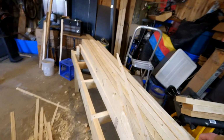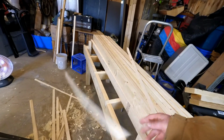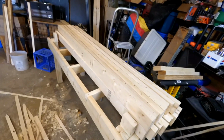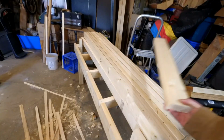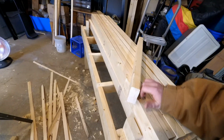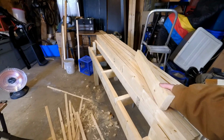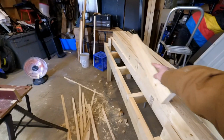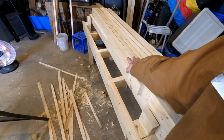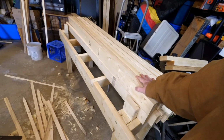So there's a pile of work in the shop today. I'm starting to make my own toilet paper there out of spruce. Let me know if you need an order. Just kidding, that's the bull noses off of these. I'm taking these 2x4 sections. There's your natural 2x4 with the rounded edges, which is great for framing and whatever, but I'm running them through the table saw, making them square edged, so they will make a more cohesive, prettier workbench top when we're done. And if you don't have a pretty workbench, then what's the matter with you, right?